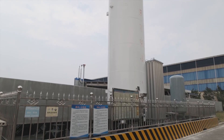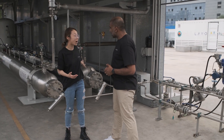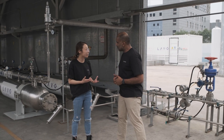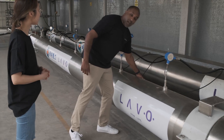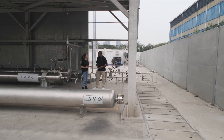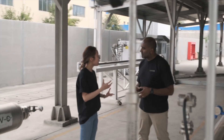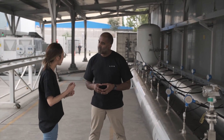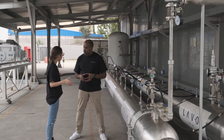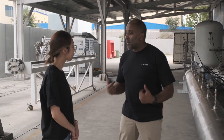Now you've seen the electrolyser and the control room. After hydrogen is produced by the electrolyser, hydrogen will actually get pumped into the vessel right behind us. And when the vessel starts to absorb the hydrogen, you can definitely feel the temperature change slightly. So do you want to feel and touch it? Just touch the vessel. Wow, you can really feel the temperature — it's not boiling hot, but it's very, very warm. How hot does it actually get? In the vessel there's a coil, and in the center of the coil it's roughly around 65 to 70 degrees. The coil is used to heat up the metal hydride to improve its performance for absorbing and desorbing hydrogen. The energy stored in the vessel is roughly around 85 kilograms of hydrogen, worth around 2.8 megawatt hours of energy.